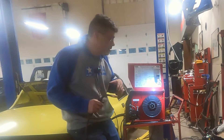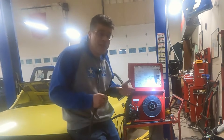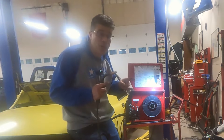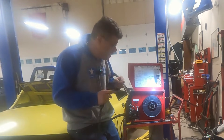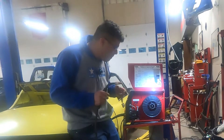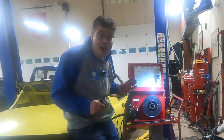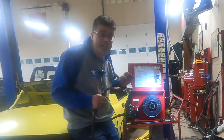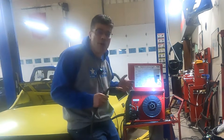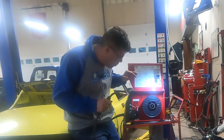Now that we've got the motor taken out, the gear section cleaned and relieved, and we've got it hooked back up again, make sure that you have the wires on the correct posts — because if you get them crossed, the motor will spin backwards and push the wire feed the wrong way. Then all these little screws and fasteners go back in. It's not rocket science, just a little fiddly — it can be more frustrating than figuring out a wrong answer on a pre-calculus exam. You just have to systematically figure out why things aren't aligning.